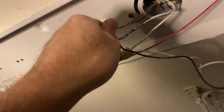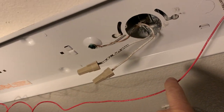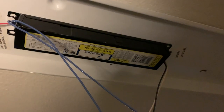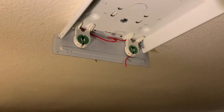With the power off, I take the wire nuts off and unhook the wires, leaving them sitting on the wires for safety. I've got my ballast here with a screw I need to remove, and that'll drop the ballast down out. I pop one side out, twist it, and it comes right out. I unhook the ballast and pull it down. I'm not going to keep the old wires, so I go ahead and cut them, and I'll put the non-electrical end of the LED tubes in this end.